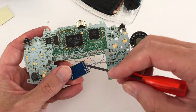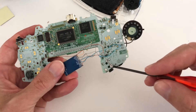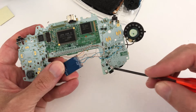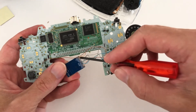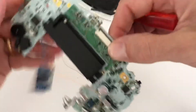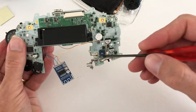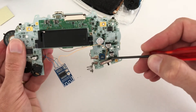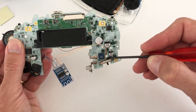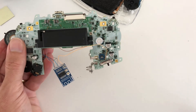Both P ground and A ground can be soldered to pin 4 of the ear jack connector. The 5 volt wire can be soldered to the common pin on the power switch. Obviously there are multiple ways to solder this Bluetooth circuit to your Gameboy Advance — we're trying to show you the simplest way.